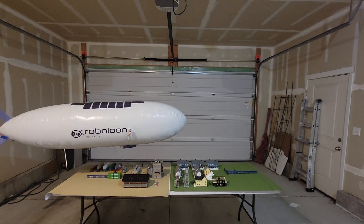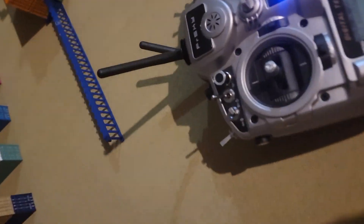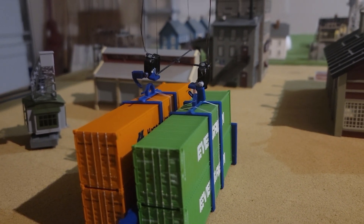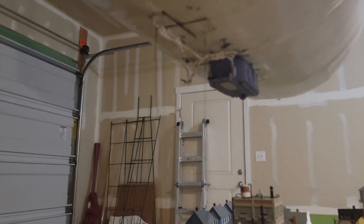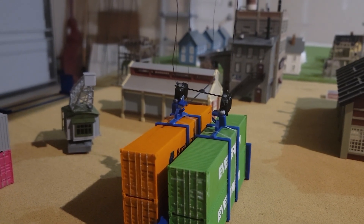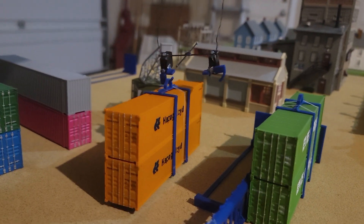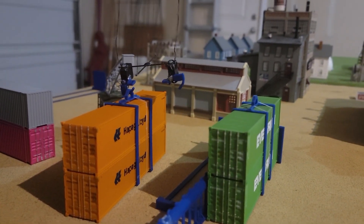I've done some modifications here — I have two servos on the bottom which have hooks attached to them. On the cargo module, you can see there are two servos attached to hooks. One hook is already engaged with the green Evergreen containers, and the other one is open and ready to snatch the orange one. That's the airship up there and the connector to the cargo. All I have to do is actuate the servo on the left-hand side and it hooks in — now that cargo is secure. Then I release the other container and it bounces up a little bit. It just has to be locked into place so that the alignment is correct to pick up the other cargo.